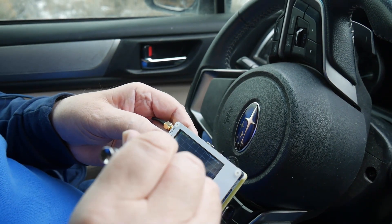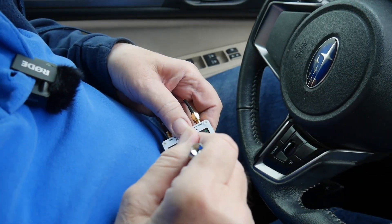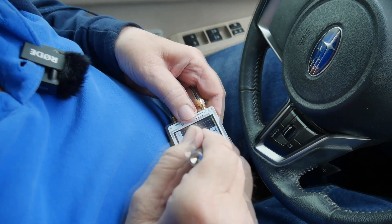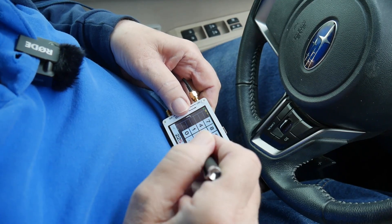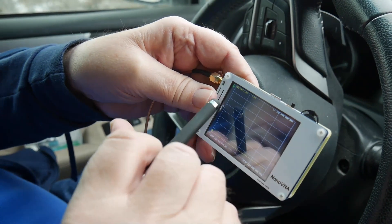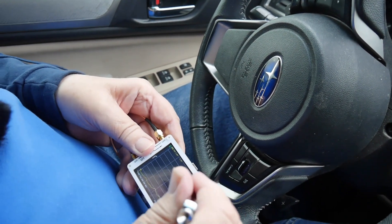Okay, let's check it on 220. We're going to set the start to 221 megahertz and stop at 225 megahertz. It says over here that it's 1.35, so it's under 2.